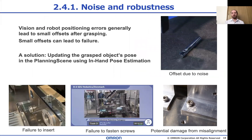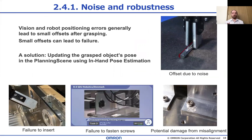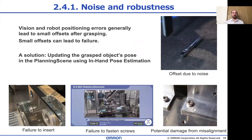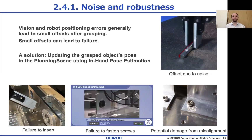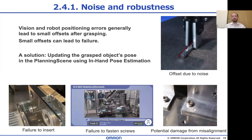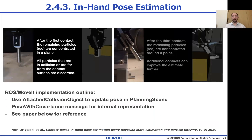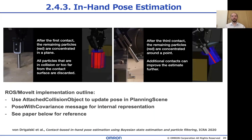Lastly, I definitely need to mention robustness, which is extremely important for the assembly task. There's always unavoidable noise in the system in all of the components, and those small errors often lead to failures like parts getting stuck or slightly missed grasps. Dealing with this uncertainty is a big challenge. While cameras are often used for detection, we've had so many calibration issues that we wanted something simpler. So instead of using a calibrated camera with all of the potential calibration errors, we touch the environment with the object to determine its position as necessary. Every time we perform one of these touch actions and bump into the environment, we gain knowledge about the object position. In our paper, we show that this method can determine the pose to submillimeter precision, and it works in ROS as described on this slide.